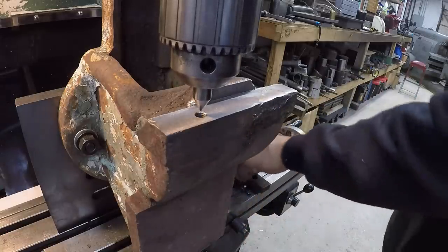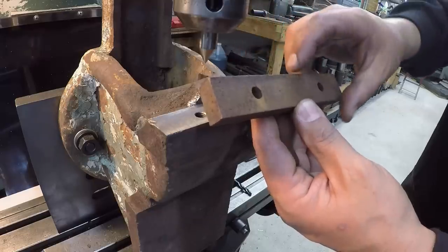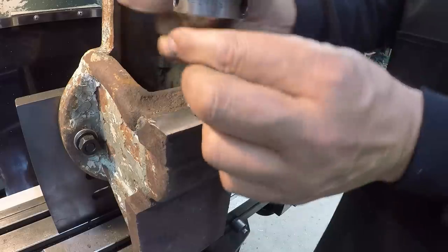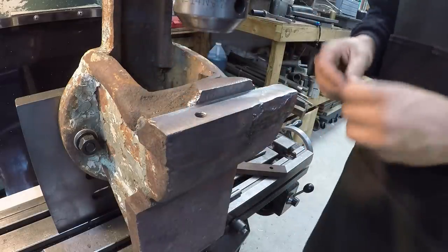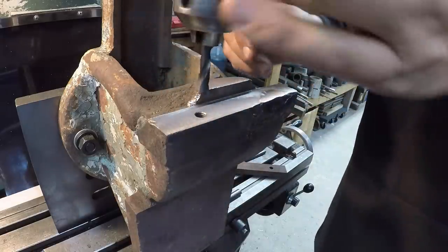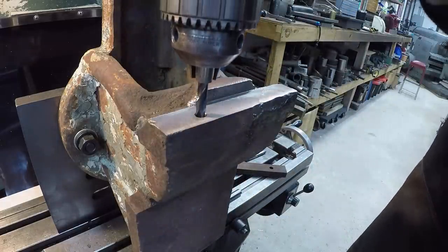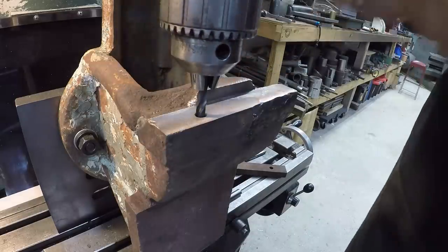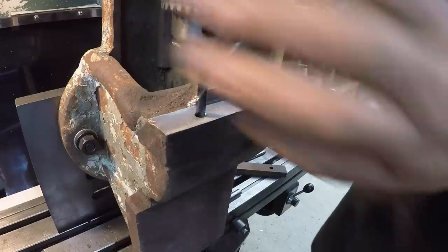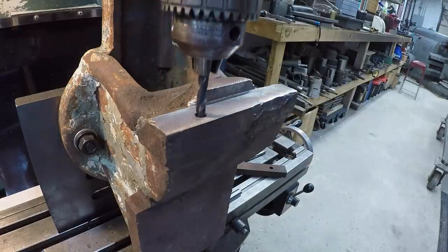You've got it. I measured the jaw right there, and you've got quite a bit of play with the bolts that are gonna go through these through holes right there. So we should be in the center of that. Matter of fact, what I'll do is take the center out, and then we're gonna use our tap drill. Okay, well, let's just run it down in there. So when I go both ways, it drops right down in there and it's not hitting the threads anywhere. So we should be within 2-3 thousandths, I would say, being in the very center of that hole.